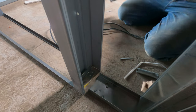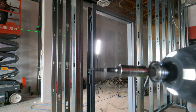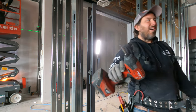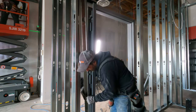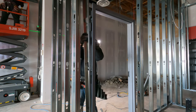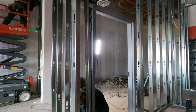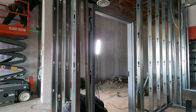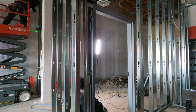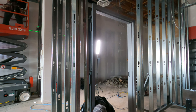I'm using the impact driver with regular framing screws — the pointies — for light gauge framing. I've pre-put the clips in at the top hinge and middle hinge. I've cut the tabs off so I'm not wrapping the tabs around the stud — doing it the proper way in this situation. At the end I'll show you an example of using the tabs as well. Right now I'm putting in the bottom stud, pushing it in and squaring it.